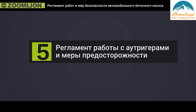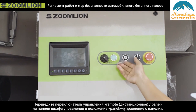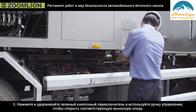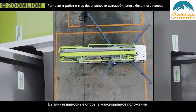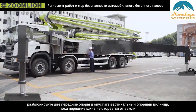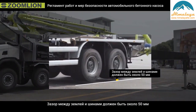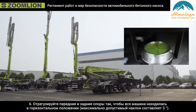Fifth, out-trigger operation methods. First, turn the remote panel control switch on the electrical control cabinet to the panel control position. Second, open the mechanical lock of all out-triggers. Third, press and hold the green button switch and operate the control handle to open the corresponding out-trigger. Fourth, extend the out-trigger to the maximum position. Fifth, according to ground conditions, put suitable pads and open the two front out-triggers, extending the vertical cylinder until the front tire is above the ground by around 50 mm. Sixth, adjust front and rear out-triggers to make the whole machine horizontal; the maximum allowable inclination is 3 degrees. Seventh, confirm all control handles of each out-trigger have returned to the neutral position.